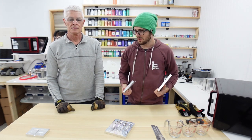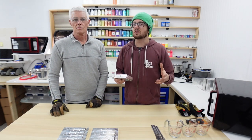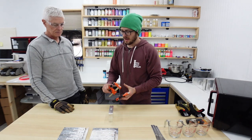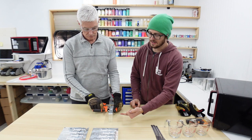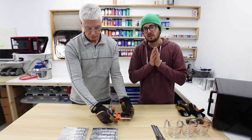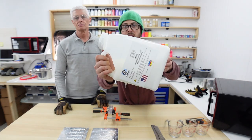We're starting with the tail mold — this little guy has four cavities. Lizards are one of the key baits in some areas of the country in the spring, so it's a great time to shoot this new mold. First, get the mold down, grab some clamps — put one in the middle on one side and the other a little higher than center line on the other side. If you put both clamps at the top or both at the bottom, you'll split the mold open and the plastic will rush out.